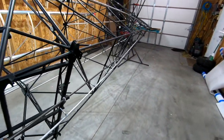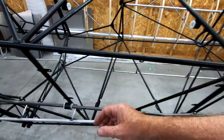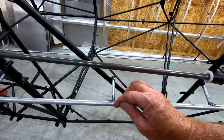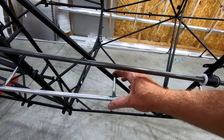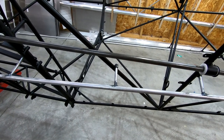And then once I had them all clamped in place, you need to make your measurement. So you basically say, all right, from the top here, visually, inside there at the bottom is going to be whatever it is, 2.5, let's say. So you've got to make sure that when you cut these, you account for that. Otherwise, you'll be shorter and tighter than you thought.